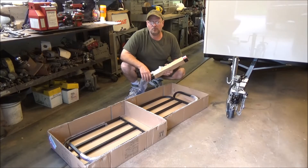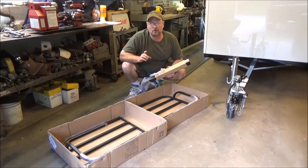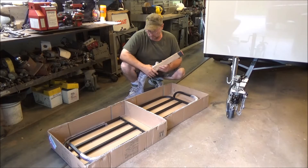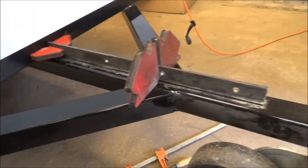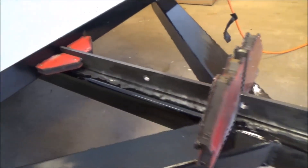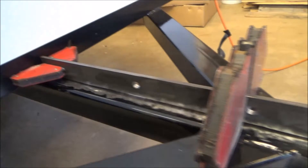It'll take a little while to figure it out, but as soon as I do I'll come back and let you know how I'm going to mount it. All right, here's what we came up with. I got a piece of quarter-inch steel — I needed an inch and a quarter but I just cut that down and got a piece of quarter-inch steel. Now I'm going to weld that on there.